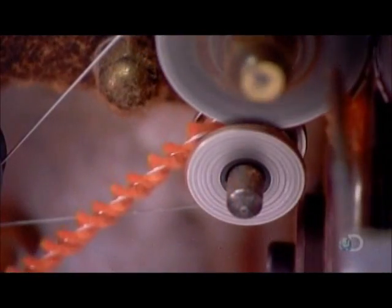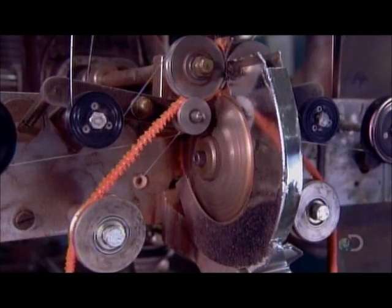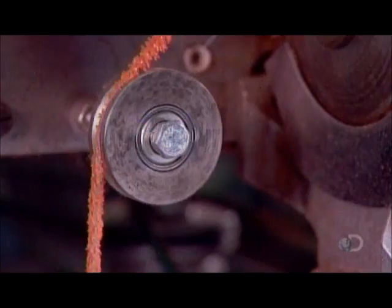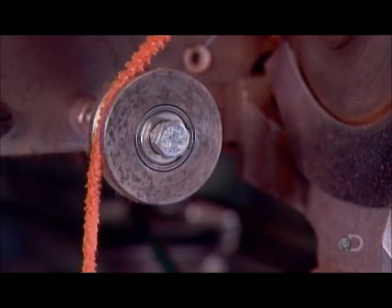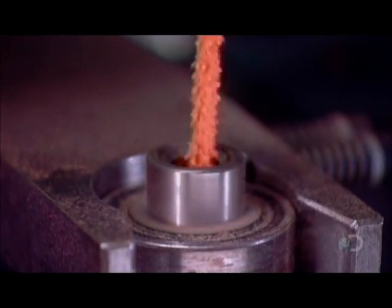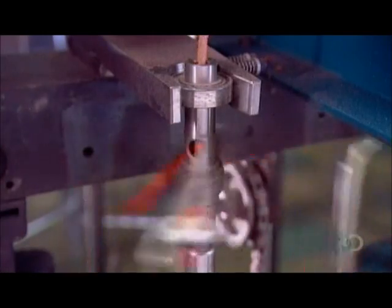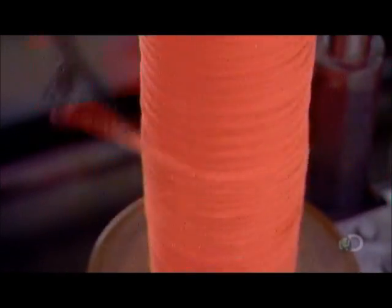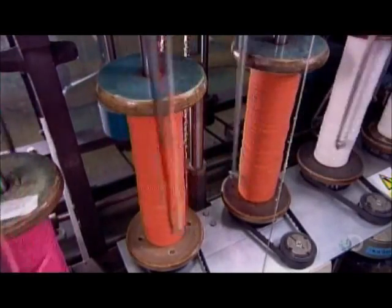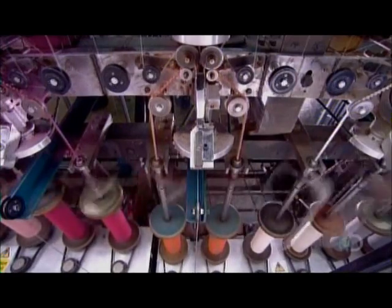At the same time, the wires run in grooves around rotating rollers, and those yarn tufts now become trapped between the 2 wires. Together, the wire and yarn tufts then travel over other rollers into a device called a flyer. The flyer was invented for twisting yarn. Each time the flyer rotates, it inserts 1 turn into the pipe cleaner. Bobbins then wind up the pipe cleaner. It all happens so fast, it's a bit of a blur.